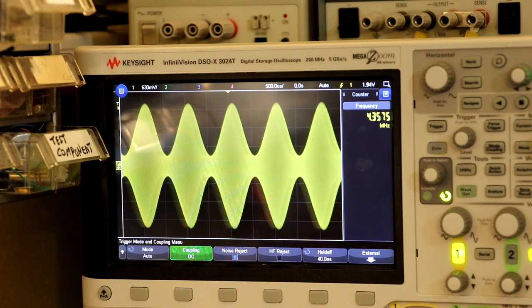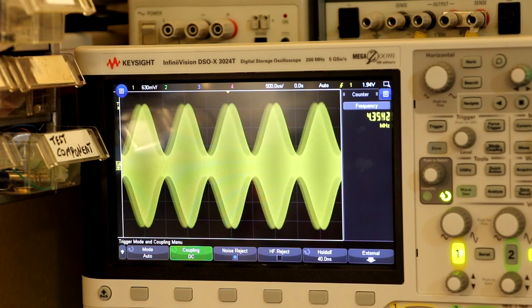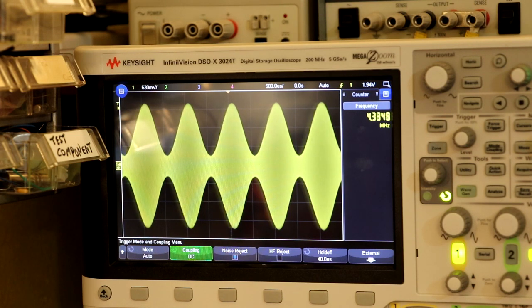So have we got a faulty component? Have we got somebody who's done some kind of power-up mod, which is what I suspect, although I can't see anything missing. Well, I've got to admit, I'm not sure what's going on with that modulation circuit, but in fairness, I've not even had a look at the circuit diagram yet. I've just checked the obvious things, like, are there any components? Does it look like there's anything missing? Is there anything shorted out? Are there any bodge wires? Certainly can't see any of them. So maybe we'll have to dig in a little bit further.